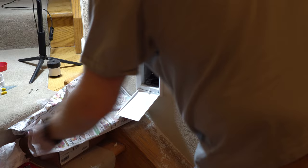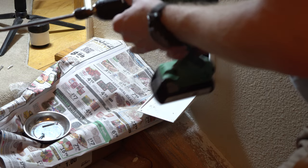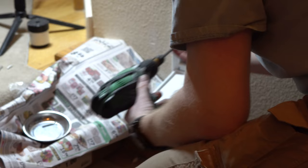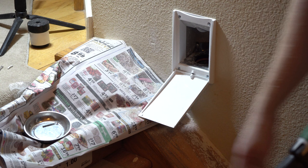I've had to do an unusual amount of trimming on mine. Now we're going to put this plate on. This is kind of like changing a tire on a car — you want to do a cross pattern when you torque it. You don't need to go super hard on these; these are just drilled into plastic, after all. Now that shuts.